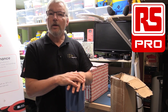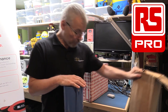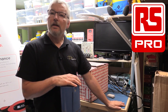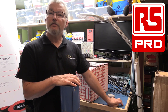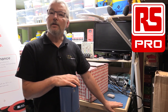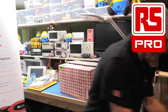This is one of the anti-static mats you'd put on your bench to protect your devices and yourself, keeping everything grounded when working on open equipment. They're also typically heat-proof. If you put a resistance meter on it, it'll measure hundreds of megs or even into the gigaohms. The idea is it prevents static from building up, but the high resistance means that if you put a powered PCB on it, it won't have any impact. They're also heat resistant enough that a soldering iron dropped on it won't damage it.